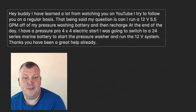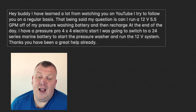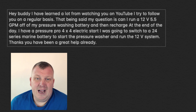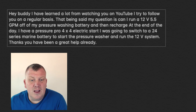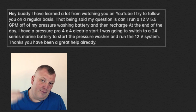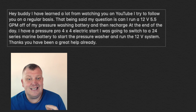So this is a great question. Yes, we can run our 12 volt off of our battery. I did it on all four of our trucks and I've done it on 10 or 12 of my builds. I do like upgrading to a marine battery versus the battery that comes with the pressure washer, because that little battery is basically a lawn and garden battery. It's not really designed to be ran down and charged back up repeatedly, where a marine battery is designed exactly for that.